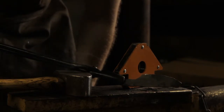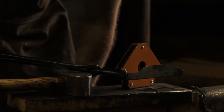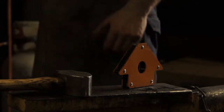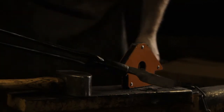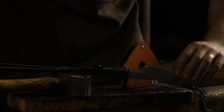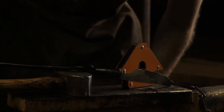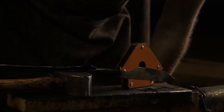Important thing to remember is when cooling down, steel doesn't become magnetic again at the same temperature as it lost its magnetism. That can be a trap for new players. I only want the blade to basically still be magnetic. As that cools down now, I'm just going to keep it in still air but what I don't want to do is put it on top of the anvil where it's going to operate like a heat sink and differentially cool the steel. I'm starting to wonder whether I gave myself enough space here to actually crack these samples — still looking pretty meaty but I'll just grind them down.